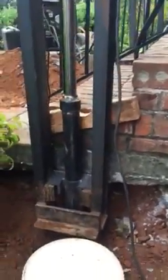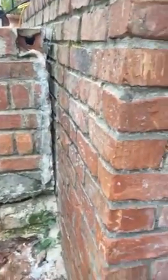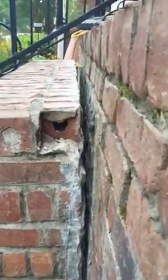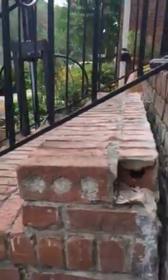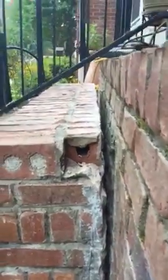So we've put in two piers, one on this side, one on that side, going down to a bedrock base. And this is going to allow us to hopefully get these steps back into place. So let's crank that machine right over there and see if we can get her close. We may have to walk it a little bit at a time.